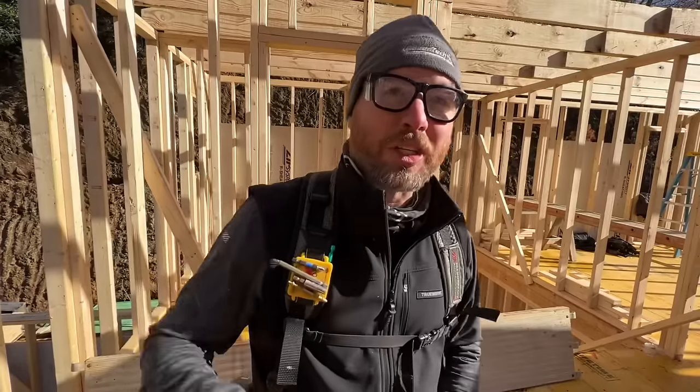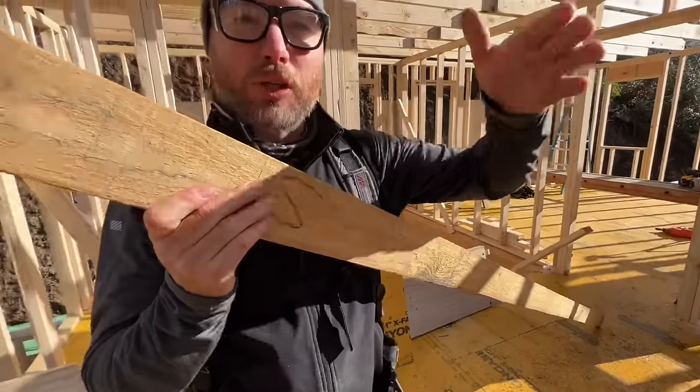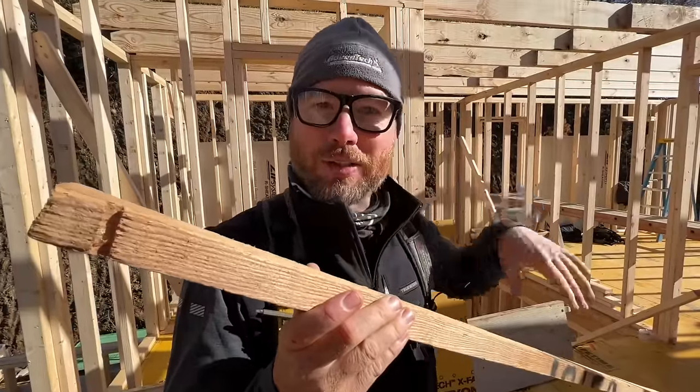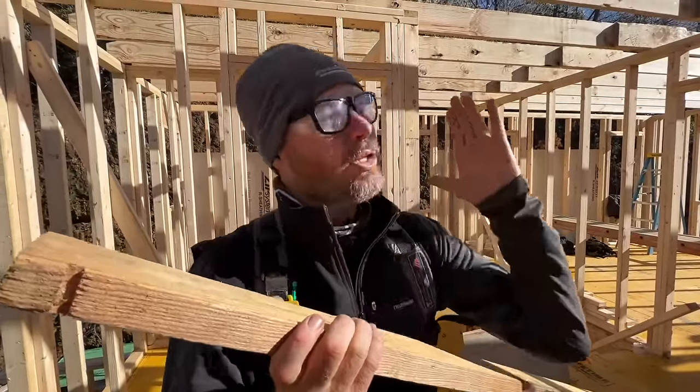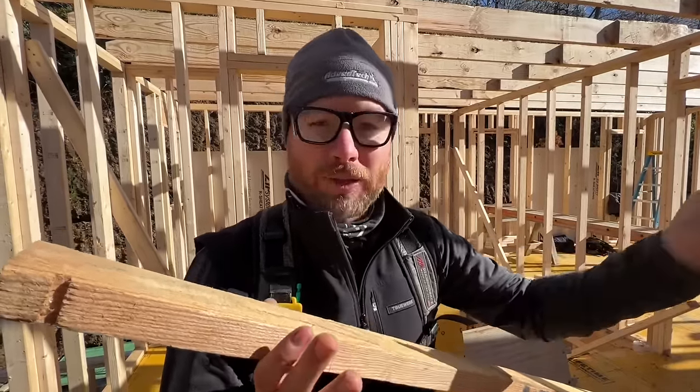We got our ceiling joists up. That's great. And our next move, before we put the rafters up, we're going to put some boards down on top of our ceiling joists called rat runs. I guess little rats could run on these things in their attic or something. But the reason for them is to space all the ceiling joists to the correct spacing out in the center of the span, because they're probably bowed left and right like crazy.